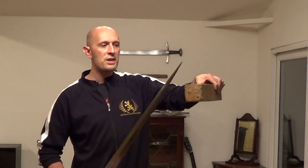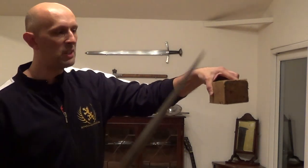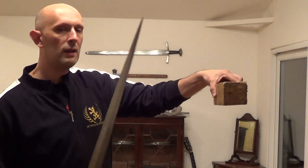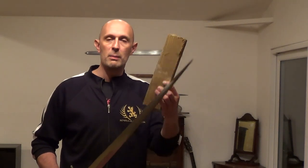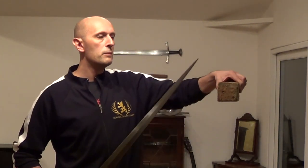Very simply, you get your piece of wood, get an edge or a corner. Now, you'll notice I'm hitting the thing with the tip, and I can actually feel the sword bouncing. If I just let it drop, it bounces off. What you don't want to happen is you don't want your blade to bounce off the thing you're hitting. The centre of percussion, otherwise known as the sweet spot, is the point of the blade which exerts the most force on the target.